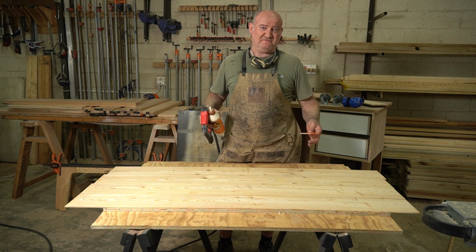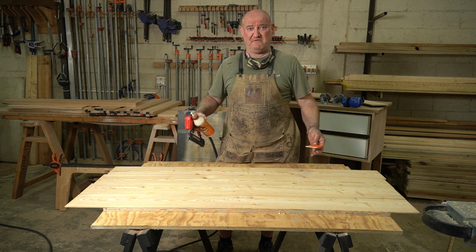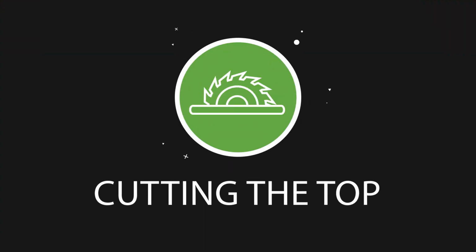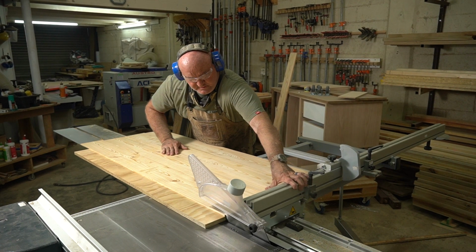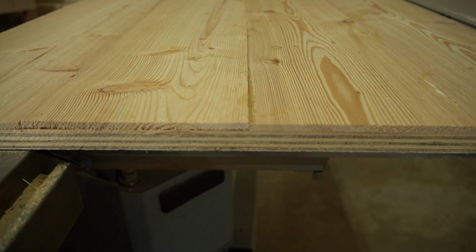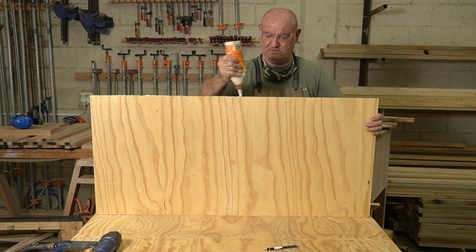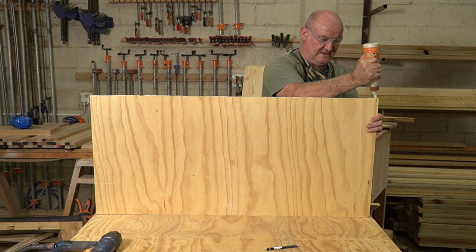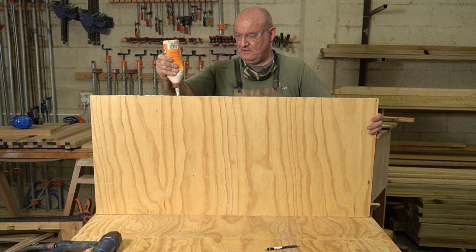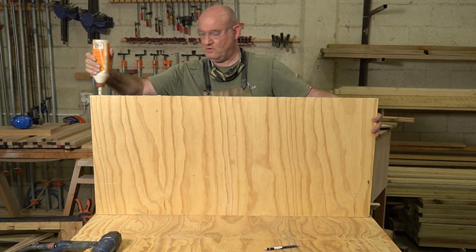Of course, like I said, you don't have to have a fancy pin nailer. You can just use glue and some heavy weights, get a brick, your fat friend, whatever. Just put them on there, hold it down, wait until it dries up. It's all good. Loads and loads and loads of decent glue, and the whole idea here is that the pins will hold it in position while the glue dries. Once the glue dries, it will do the bulk of the work.